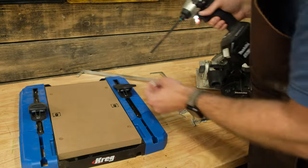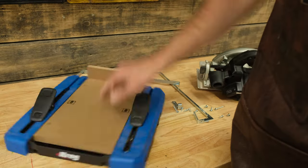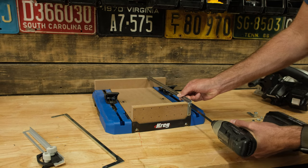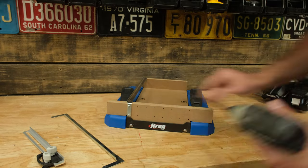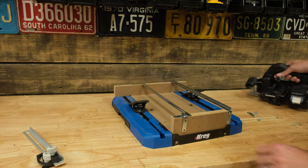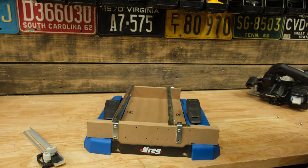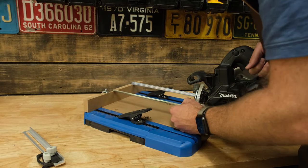Assembly is a breeze — just make sure you're putting everything in the correct direction, unlike I did before. Put in this backer piece first; everything is already pre-drilled so it lines up very accurately. Even with the same screw holes I had before, everything was perfect. For assembly, put in the rails — one goes on the opposite side first. It all depends on whether you have a left-drive or right-drive circular saw. Set it up accordingly, put the rail facing inward, then put in the other adjustable rail. Size it up first, line it up with the holes, add the screws, and you can do micro adjustments. There's a little screw you add on top so you can slide everything. I recommend grabbing a square and making sure the rails are perpendicular and parallel to each other. A little machine screw tightens everything up, and then put the actual saw on and line everything up.